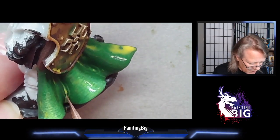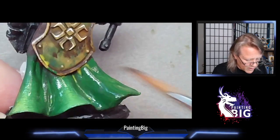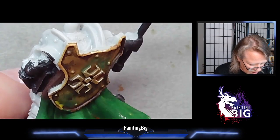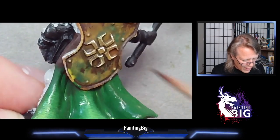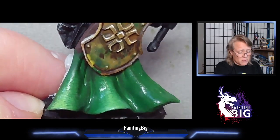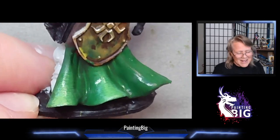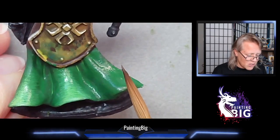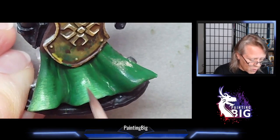You need to move pretty quickly because you don't want it to start drying or you'll get weird artifacts. Try to keep your brush near the edges if you can. Be aware that if your paint starts to dry it's really easy to strip up part of the glaze and wreck your surface — that's why this is the more nerve-wracking version of applying a glaze. Nonetheless it is the best way to do it over a big surface. You've just got to move fast and use a brush big enough to cover the surface super fast and wick off all that fluid.